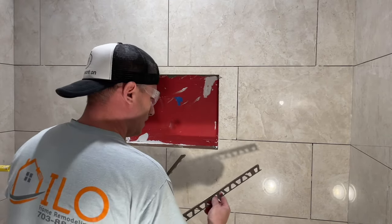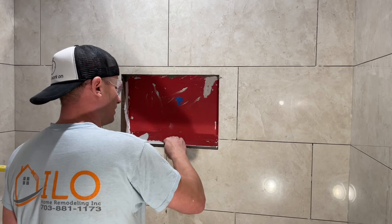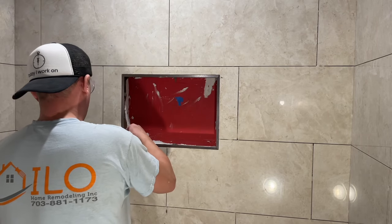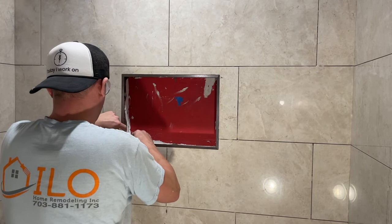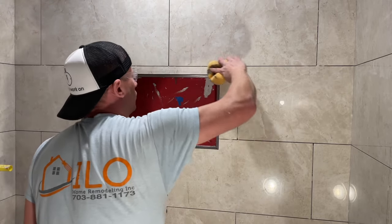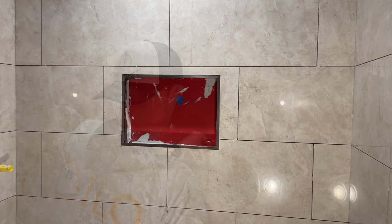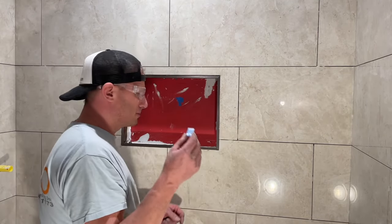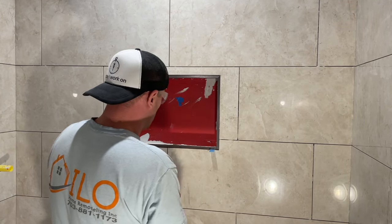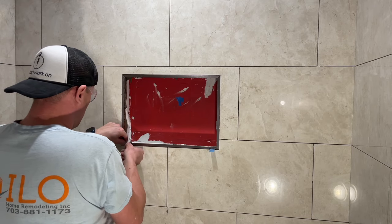Next up, let's place the jollies in the mortar and let them fit well. Once I'm done with the tiles, I'm going to use blue tape to hold everything together. Now that it's all cut, I'm going to use some shims because I want a little grout space — shimming it up about a sixteenth of an inch.